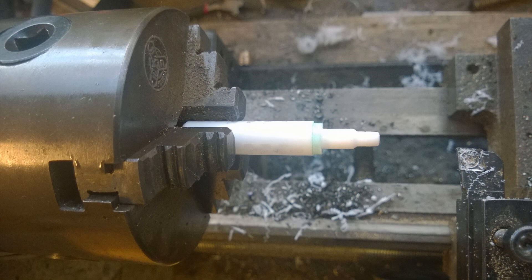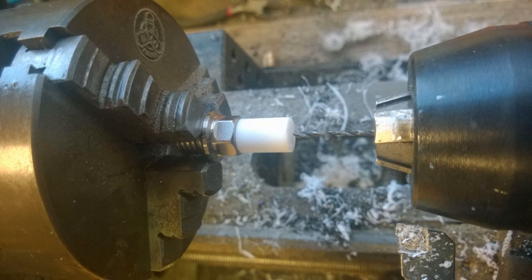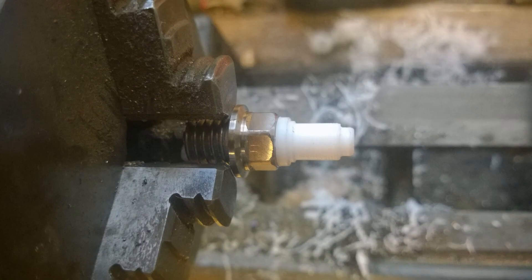Really you would want some kind of proper insulator — some kind of ceramic, or glass is another good one. As you can see here, I fit it into the plug and then I'm drilling what I think is a 1.4 millimeter hole, then I finish off the outside. Before I move on: if you're doing something like this in a soft plastic, because PTFE is a soft plastic, the best thing to do when drilling a small hole is to take your time and peck very, very slowly. If you try to peck with a 1.5 millimeter drill bit quickly, even though the material is soft, it will deflect the drill bit. I also try to drill through as much meat as possible before I machine down the outside profile.